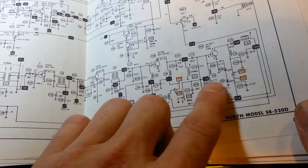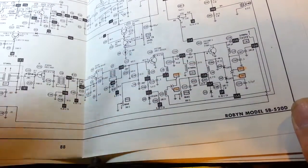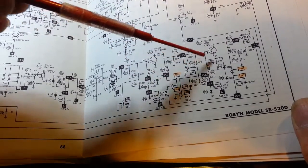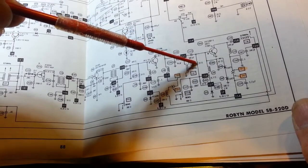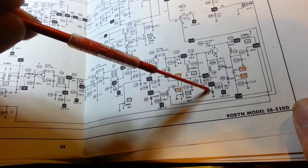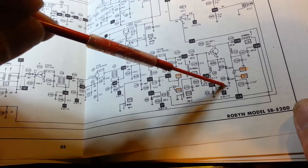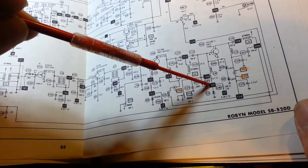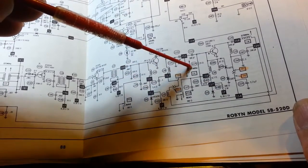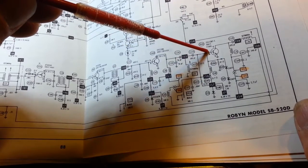They have a really wonky bias circuit. Even Mark said he never figured out what the hell they were thinking when they designed it. Well, in this radio, you don't need a bias circuit. You quite literally could cut it here and here, which is what I'm going to show, and the radio works just fine. I pulled that transistor, and I still had voltage at this point right here. I removed R180, pulled this resistor, and I still had about 0.7 volts here at R157. What the hell's going on with this thing? I pulled R179 and L44, and I still have 0.7 volts on the base.